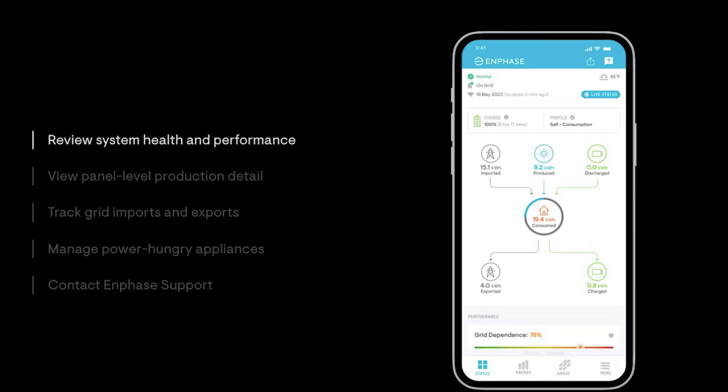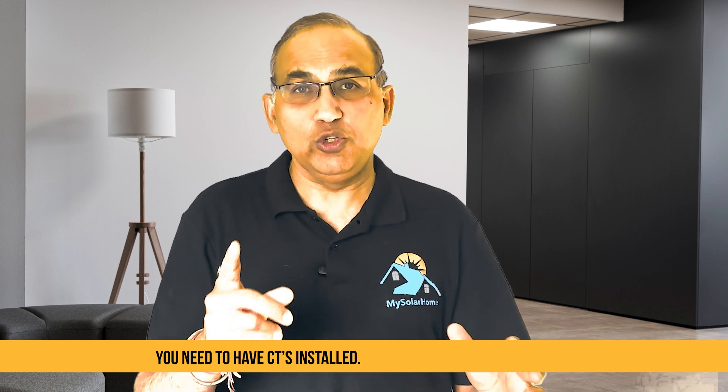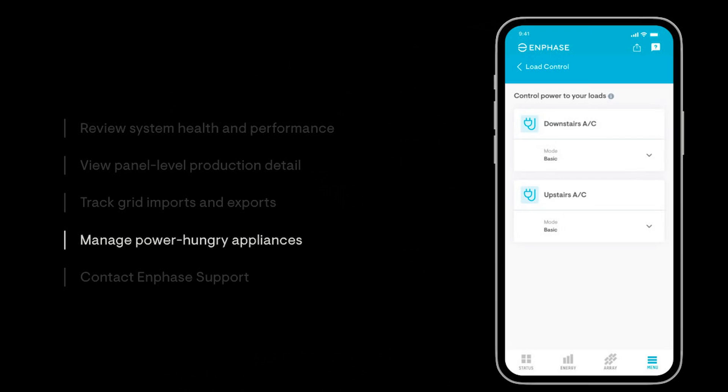It's not as elaborate as a full-fledged smart panel, but you can, for example, designate two large loads to drop out automatically when backup power kicks on. Enphase's app gives you insight into consumption per circuit — you need to have CTs installed, so make sure you ask your installer. The installer can set up essential versus non-essential loads in your design. If you do whole home backup and the draw exceeds what the system can handle, the system has the intelligence to switch off loads to prevent that from happening.